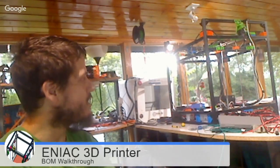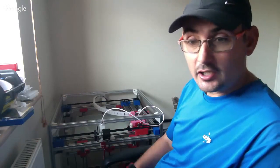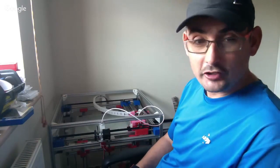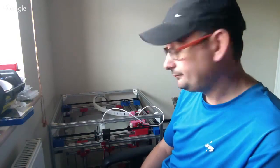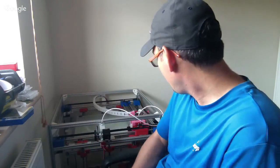If you want to touch on it real quick before we finish, as far as what plastics to use, Colin's got PLA. I have the majority of PETG with some PLA. Vince, I think, has a majority of ABS and PLA. For me, I've always printed in PLA and never had a problem, but I always print PLA at 40% infill. All my parts as well, even PETG, are four walls, four top and bottom, 40% infill. Same as me. I'll make a note on the bottom. If people are going to start to print stuff over the next week or two, it's quite important to remember that, because otherwise you want your strength.